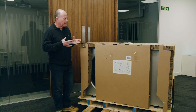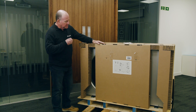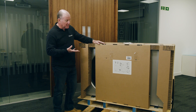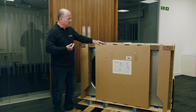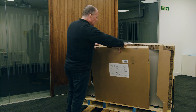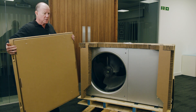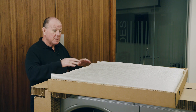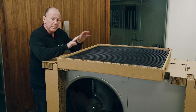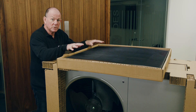There's also a separate cardboard box on the front of the unit. This box contains the plastic discharge grill for the unit. It's plastic so it's obviously breakable, so my advice would be to get this box to a place of safety as soon as possible. To remove it, simply pull the box towards you, it comes out of the packaging — catch hold of it and move it away to a safe location. The grill has a protective wrapping within the box. It simply clips into place on the front of the unit, and there are four supplied bolts to secure it.